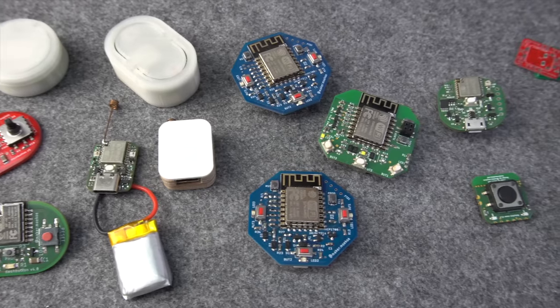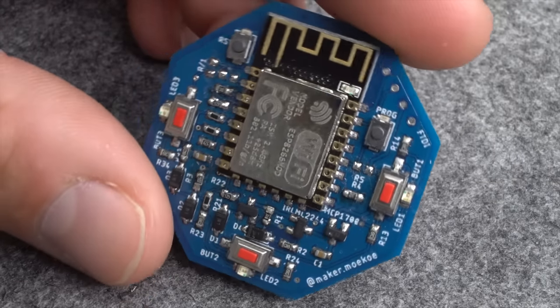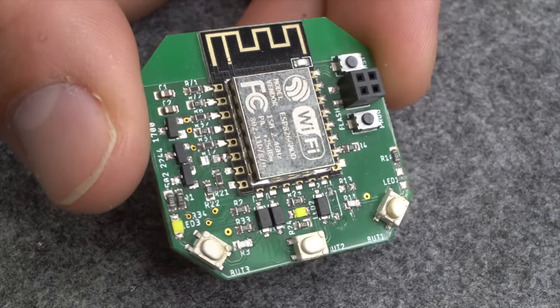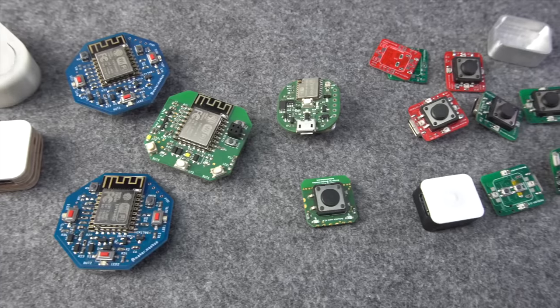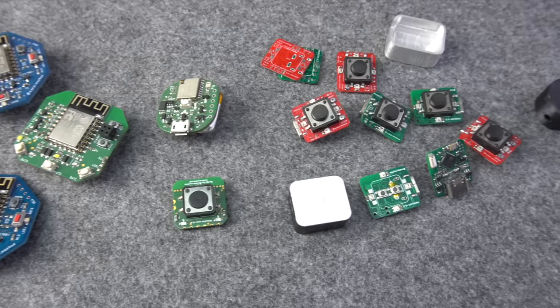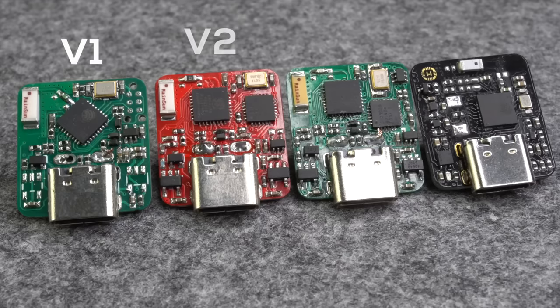Starting with the Octoclick, the so-called power latching circuit was born. It has the huge benefit that the buttons can be used in another way. It can handle a long, a short or a double press, just for example. All this wasn't possible using the reset line of the MCU, which can only be used with a single button press. With the power latching circuit well tested, it was time to go smaller, and so I worked on